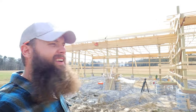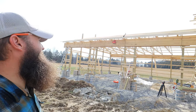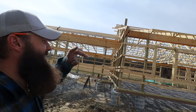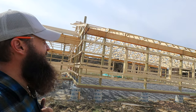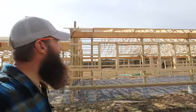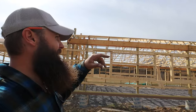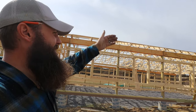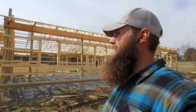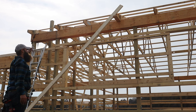We are done with the front of the garage. Got a little break in the wind — it's nice and straight, and it's boxed in. Moving to the front of the house to try to get that knocked out. That last purlin is already there on the house, so we should just be able to run across with the fascia and not need to add that purlin, which should speed things up a little bit. Got a different mount on the big camera — hopefully that'll help with some of the wind noise.